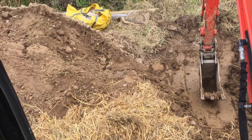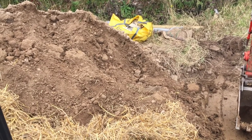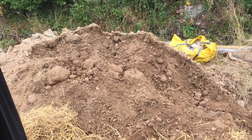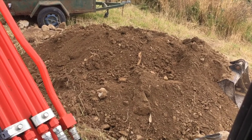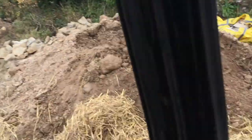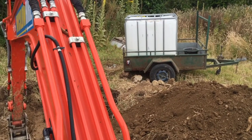The first thing is to set up all your materials. This is clay from Wexford, where they have almost pottery grade clay — every time they dig a hole it's known as marl. We got 20 tons of that for 150 euros delivered from just down the road in Wexford. This is subsoil we've been digging out from where we're lowering the ground level ready for our kitchen. The last ingredient here is straw, and of course we've got water, which we've rigged up so that when I open the tap it pours down into the bucket or the hole.